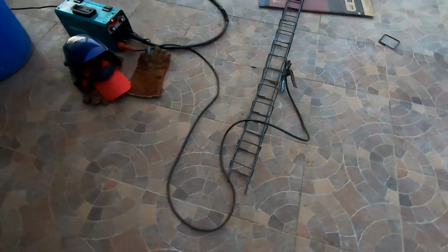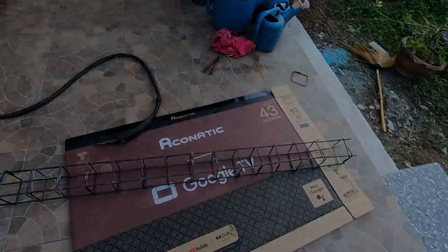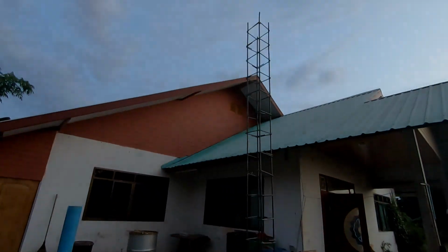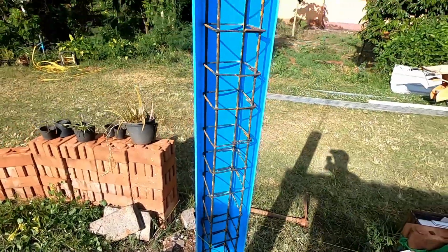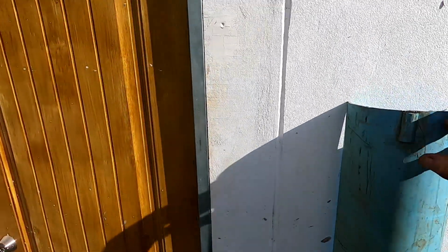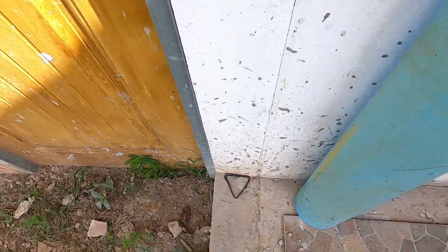And there we go, one down, two to go. And there it is in situ. I've got two of the reinforcing steel in. Got the end one here, it's not pretty, but it's plumb. With this end one against the pillar, I'm not going to put a whole post up, just half. So I'm going to bend the steel, make a triangular reinforcement, have half going up. And I'll probably chisel a bit out of the post, just to put it in a bit further.